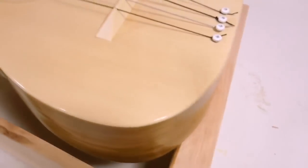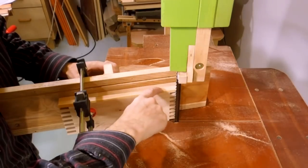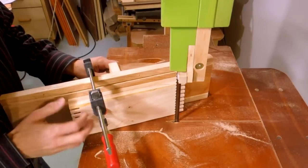I've got all my angled box joints cut, so now I can start shaping this. I need to cut a curve out of here. I've made that curve a little bit more generous, and I'm going to use my resaw fence to make sure this piece stays vertical.